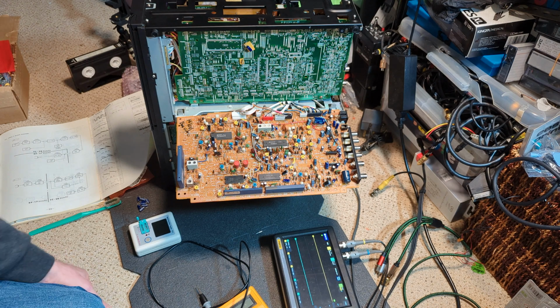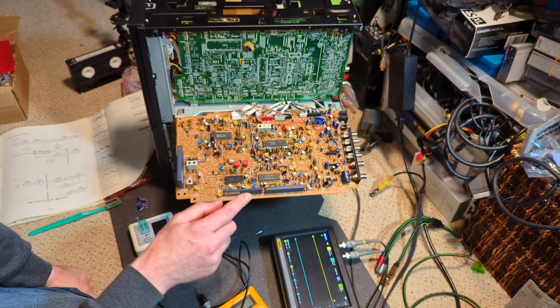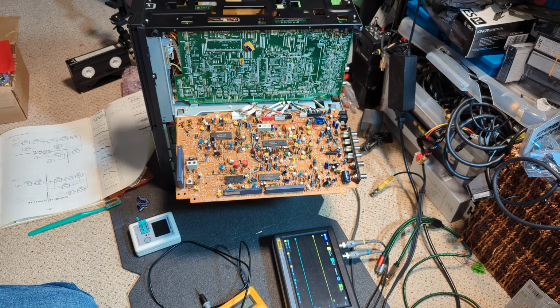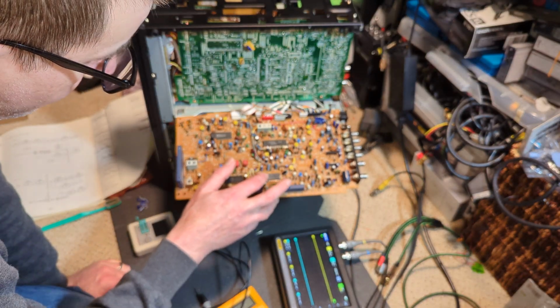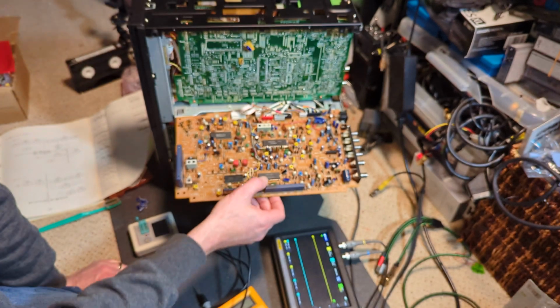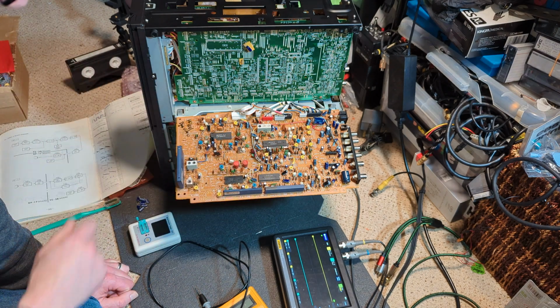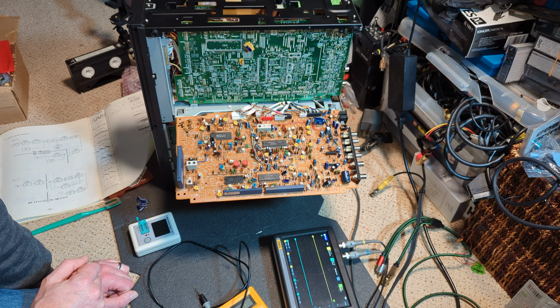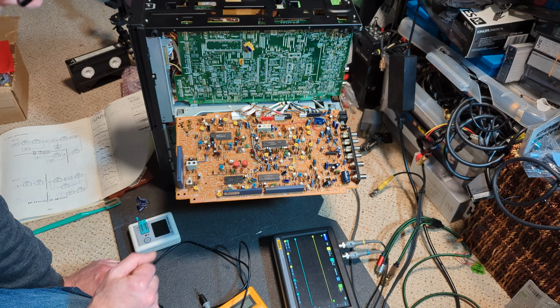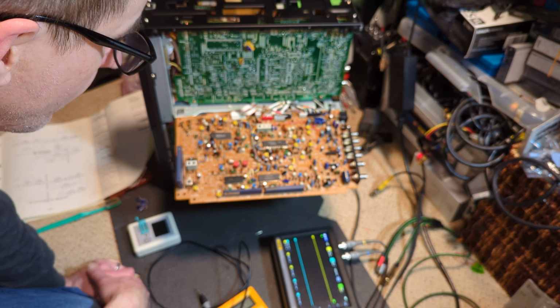Okay, well, I have been slightly chasing my tail because the signal is getting through. It's just very messy. This chip's been changed a fair while ago, by the looks of it, but has all the same been changed. Cut to the chase. Basically, I started getting an image. It was very broken up, black and white, tearing terribly, wasn't in sync. And it started to improve, which sort of suggests capacitors. So I did try freezer spray, I tried some heat as well, made no difference.